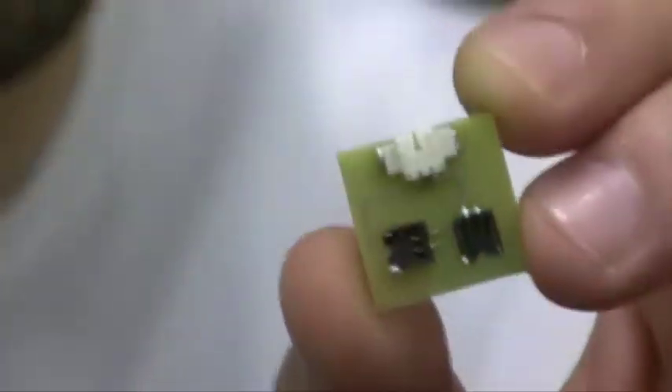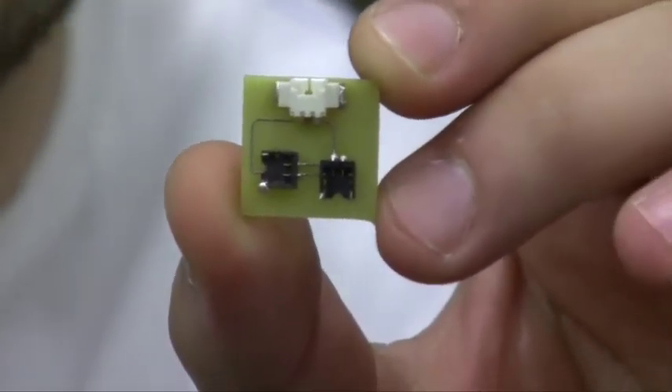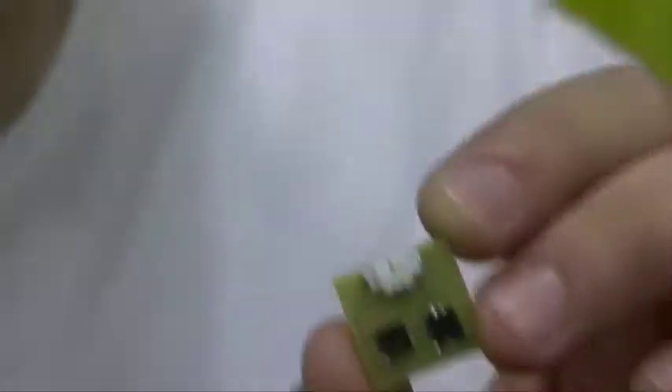Since we're talking about ACPI — as some of you know, Apple changed the connector on the power button with their 2009 models, so we had to scramble and make a new Y cable for the Mac Minis. This is a sneak preview of the new Mac Mini Y cable — a tiny little PCB board with three connectors. This is the second of two prototypes; the first one had an accident. We're about to test it over the next couple of days, then send it off to production.